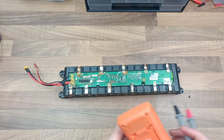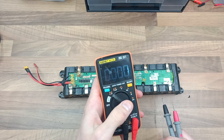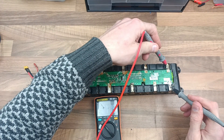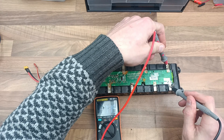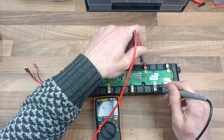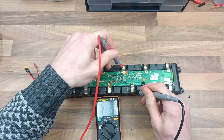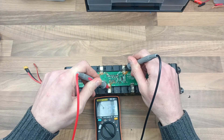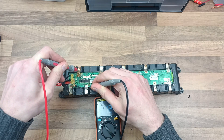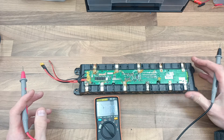I don't know if you can see the display there, but this is going to be critical to understand what's going on. So what I want to do is just check the voltages to start with. Bank one - of three - three batteries: 4.1, okay that's fine. This one: yep, that's fine, so they're fully charged. This one: yep, 4.1, yep okay that's good. This one: yep, they're good. This one: a little bit low but okay, we could get away with that one. 4.13, okay that's good. 4.12, 4.12, 4.12, 4.14, 4.14. So the actual cells are holding voltage and they're correct - the cells appear to be good.